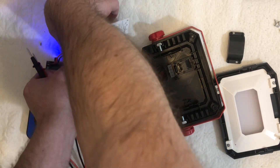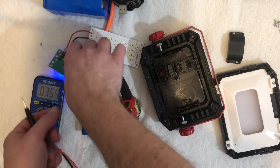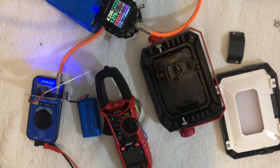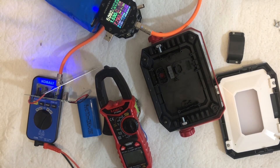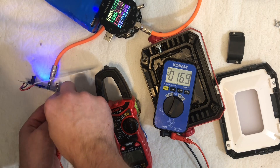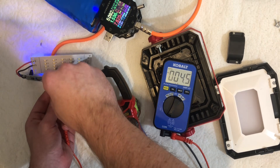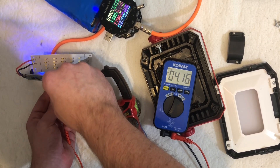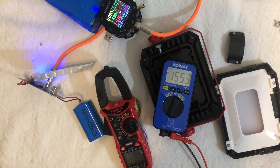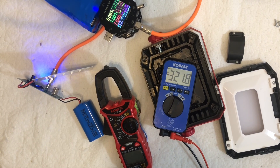I was also curious — pulling the charger off — we're not completely charged yet, not at 4.2V, so we technically haven't hit the constant voltage stage yet and current shouldn't be tapering off. We're at 4.1615V. Max input is 5V at 1.5A, unless it's the cable causing issues. Let me grab my lowest resistance cable to test.